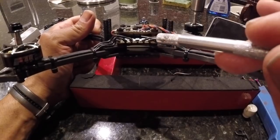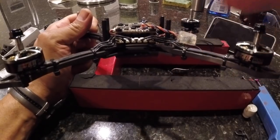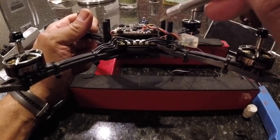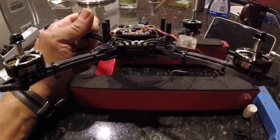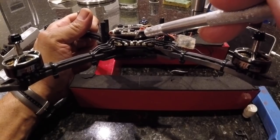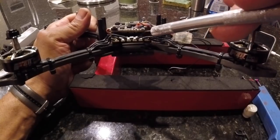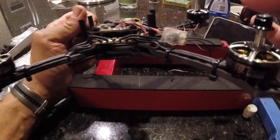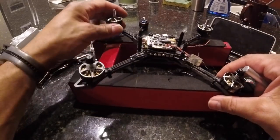The reason I have this air gap between the ESC and flight controller is great for cooling, but it's also good because radiated noise coming off the ESC — the more space I keep between these components, the less likelihood I have of any noise getting into my gyro. That noise tends to come off components like a little bubble or sphere. Even though the flight controller is over the ESC, noise from the FETs can radiate around and still affect the gyro — not as easily, but it can. So you still want to maintain space to lessen the radiated noise.